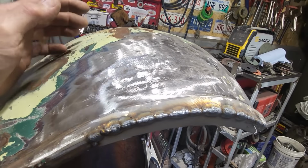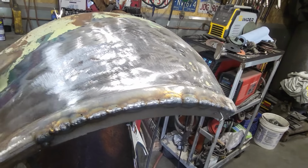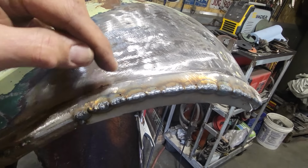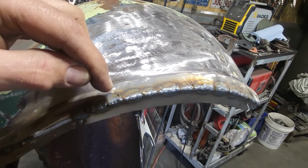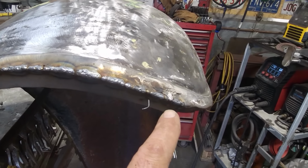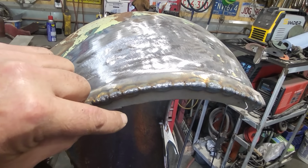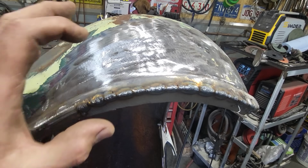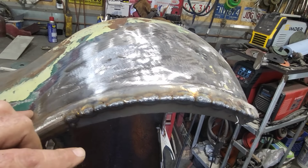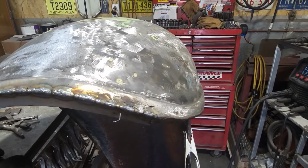One thing I want to point out here is when I'm welding stuff like this, and I'm welding a piece, or anything like that, two or three pieces, I try not to have the end of the piece end where the piece before it ends. This one over here came down here and ended here. So I trimmed off a section here to end here, same with over here. So that way you don't have a continuous straight weld going straight on down through all this where that whole spot has been worked, okay? So the weld comes down here and then it has to turn over this way and go this way to here. So that there is metal through there and same with through here. And of course that has to go over and go down through there.